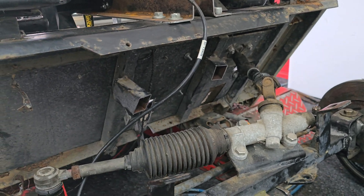What we're going to do now is pull it apart and finish off a few other bits and pieces, flip the chassis upside down, add some bracings. Next video you'll probably see the whole golf cart pulled apart. All that's left on is the motor and the flooring — we need to pull the motor out, drill all the rivets out, pull the flooring off, and load it onto the back of the truck to get the chassis sorted. Here's a lot of the parts — starting with the front axle where we had to modify the rack and remount that. We've got our new shock mounts, added a bit of camber to the front wheels, and our front lower control arms we made — all adjustable.